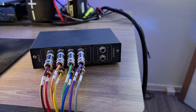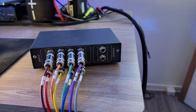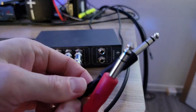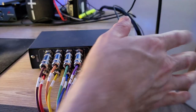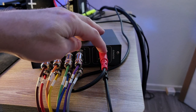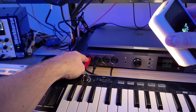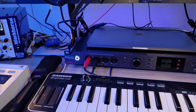On the back of the summing mixer now, I have all my connections from the rear of my interface — fed through the DB25 connector cable into the input section of the summing mixer. For the output of the summing mixer, I'm using balanced TRS cables: I'll have the red one on the left channel and the black one on the right channel. That's so I remember which is left and right — one is red, two is black — and those go into the input section on the interface.